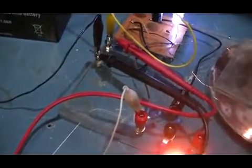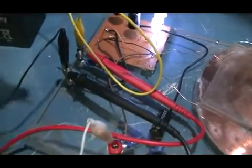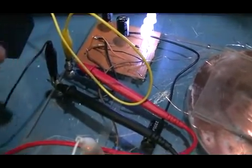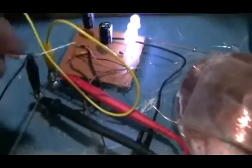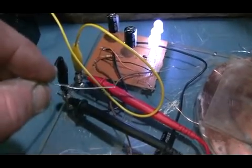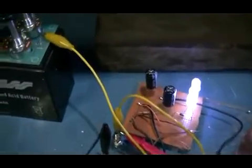The other thing is working out the total current going into this system. The way I'm thinking of doing it is to take two diodes and place them on the positive input — one in one direction, one in the other. Then our amp meters go off each of the diodes to the positive input, showing current in one direction on one meter and the other direction on the other. Those two added together would be the total current draw on our wave generator circuit.